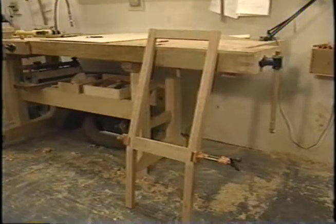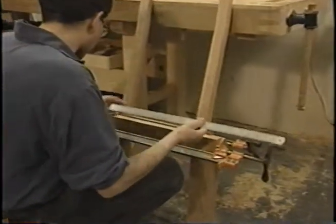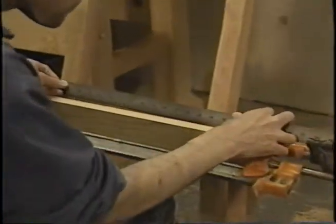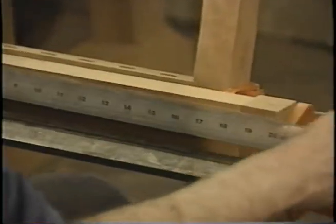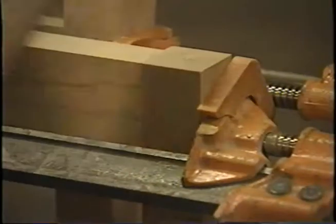But the trapezoidal seat gets us into high anxiety woodworking, angled mortise and tenon joints. Well, to tell the truth, angled mortise and tenons are no big deal. First, we've got to determine just what angles we're talking about. I could take these off from my full-scale drawings for the chair, but direct measurements are more accurate, and I've got the dry clamped back and front assemblies to work with. I take the overall widths.